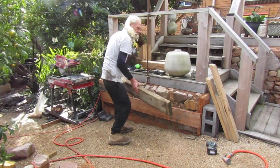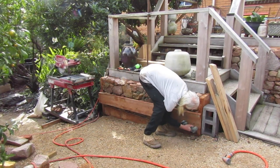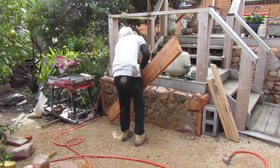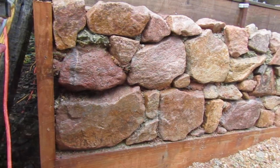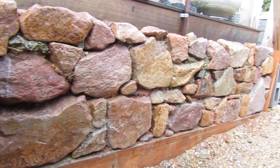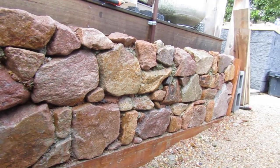This is a preview of the natural stone wall we're going to be building. But today we're going to get the concrete foundation in to get it started. There's a significant amount of stone in this wall, so we need to pour a really thick and heavy foundation to keep it solid.